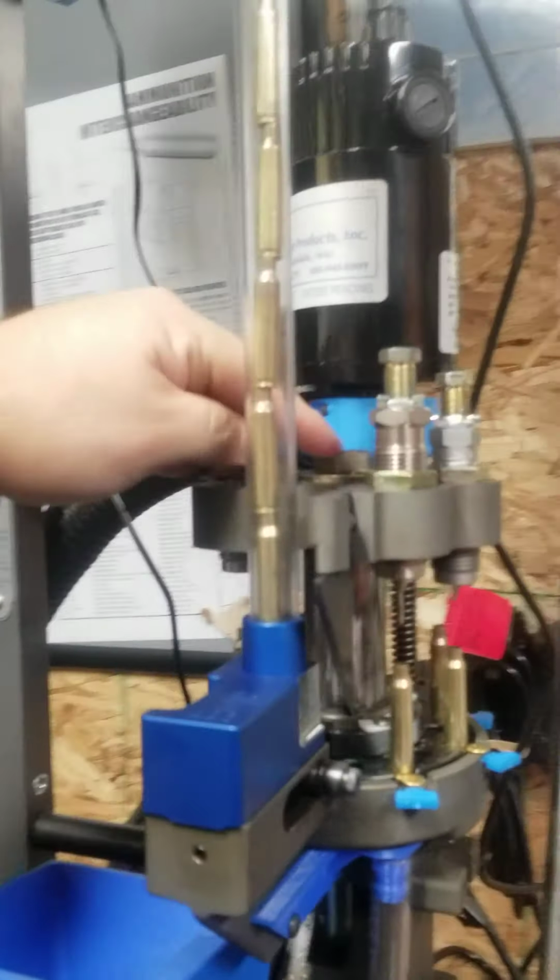Yeah, let's set the swaging rod up, and I mean, I got some beautiful brass going here. Everything's in factory spec. Running a universal decapping pin, and then my sizing die with another decapping pin, just so if for some reason it doesn't pop out there, it will pop out there. I may have to change that when I automate it.